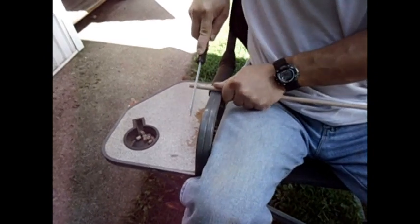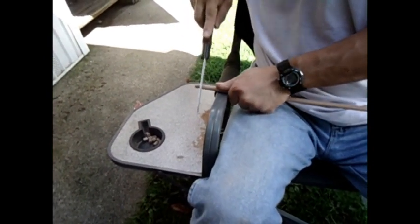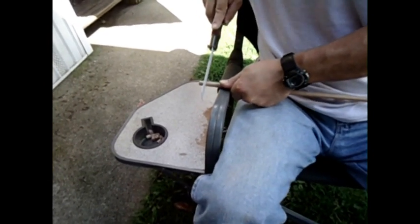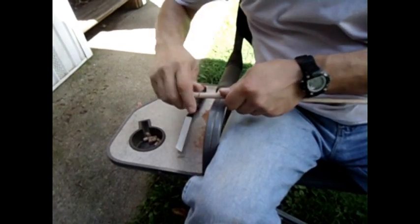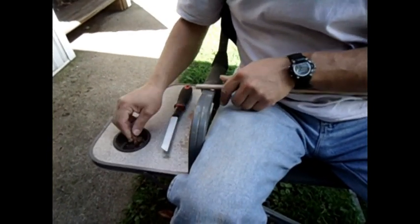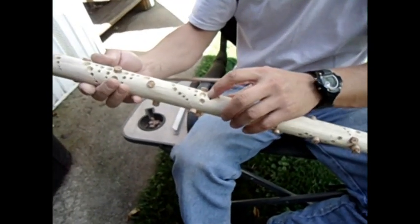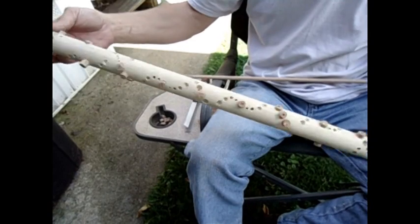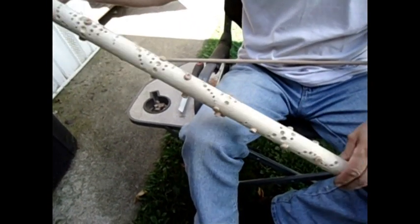What I'm doing now is cutting off the wood dowels. The secret is don't cut all the way through because it'll splinter the back and you won't be able to use it. This is a hard dowel, and I cut them off — I already did the half inch ones. You can see I put them in the holes; these are the other ones, I'm going to put them in all the other holes, then glue them in as I go. Then I'll take my Dremel and get them down as far as I can, and then hand sand everything.